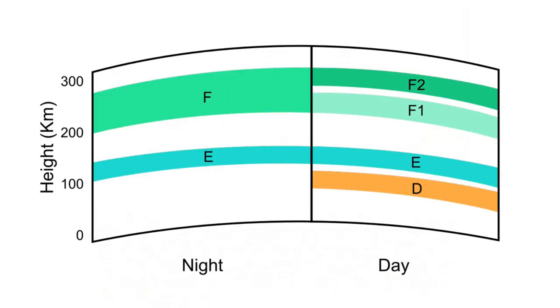Let's look at the official layers of the ionosphere. In the daytime we have the D layer, which is fairly low — about 50 to 70 miles. There's actually still quite a bit of atmosphere there, and when that layer gets ionized, instead of refracting waves, it has so much material that it actually absorbs them. This is why during the day bands like 80 meters don't work very well — they get absorbed in the D layer.